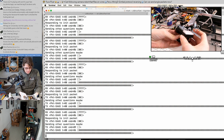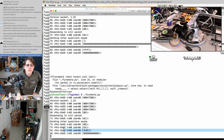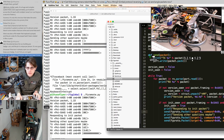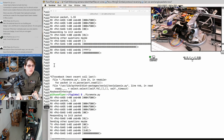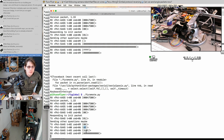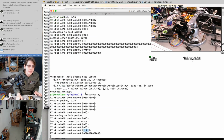What just happened? This is also not what I wanted. I wonder if this is the same space that we've been seeing in 8. Like if we send command 6s with a bunch of different keys here, will we get a bunch of different values? Is that a way we can dump its settings? Let's try that. My hunch that I'm trying to follow is that maybe this command 6 is returning something from a local configuration space, like in RAM, and that this is just an index into a table, and that this is a 16-bit number from that table. And my extra hunch is that maybe that's related to the table that we're setting with command 8.